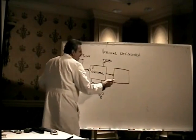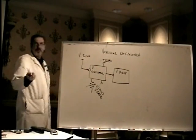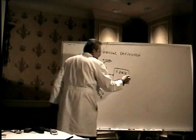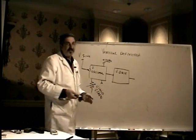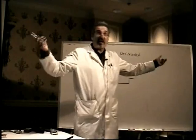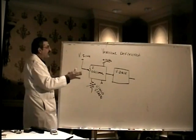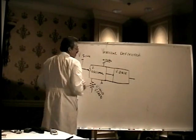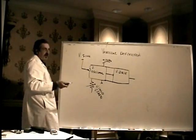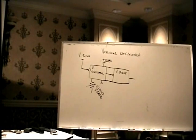It's just an amplifier stage called the vertical drive stage. And all that just does is boosts it up in current and probably voltage as well. I've never really paid much attention to it, because if it doesn't fail, I don't care about it. But that's what it's for. Now, these things are actually together in one integrated circuit. This is actually one integrated circuit that has both the oscillator and the drive. It's just a regular dual inline package IC, nothing special about it.